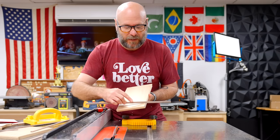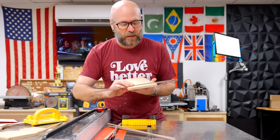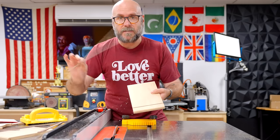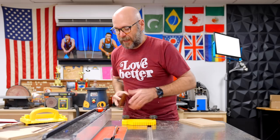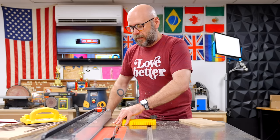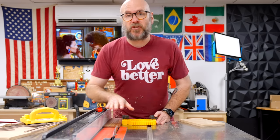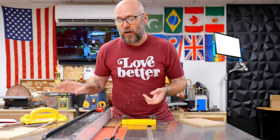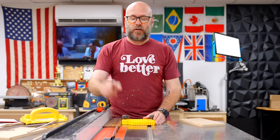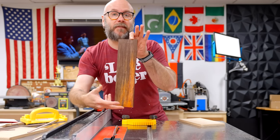Now I'm going to cut little thin strips of inlay pieces to fit in that groove. This takes quite a few tries to get that perfect thickness — it took me five tries to get the right size. When cutting small pieces like this, I like to have that small piece on the outside of the blade. I have a magnetic stop on my table saw, bump the piece up against the stop, bring my fence over, lock it down, and reset the fence each pass. This is a much safer cut — having that small piece on the outside of the blade instead of being trapped between the blade and the fence. I'm using some sort of exotic wood I got from Kencraft a long time ago — I have no idea what it is.